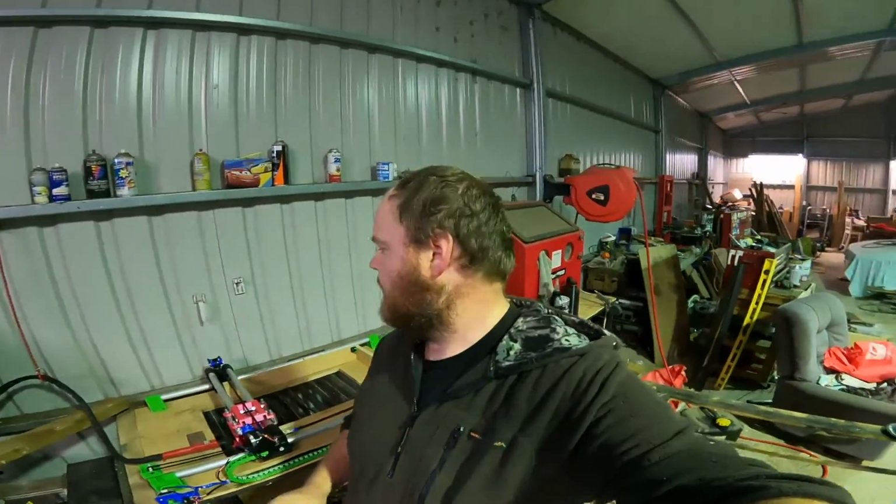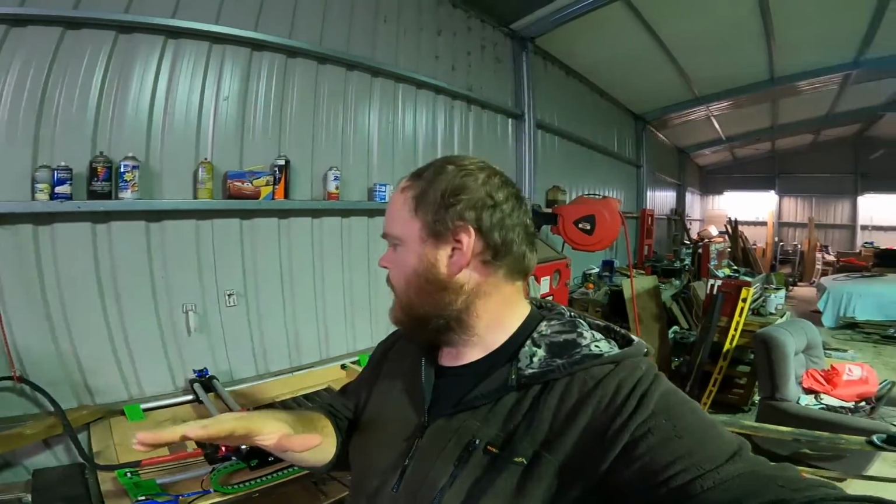Alright, so in that last video clip you would have seen it kept on stop starting, and I'm pretty sure at the end it just stopped altogether. So what was happening was the base plate, or the bed that everything was sitting on, was just mesh, and that was bending and warping under the heat, which was causing the plate that I was cutting to be too close or too far away in different spots, and it'll just break the arc.